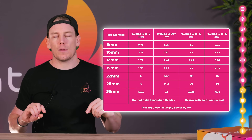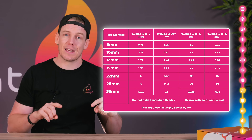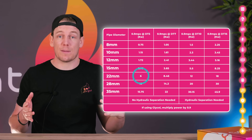That 0.9 metres per second maximum velocity is the other number shown in the top column of the cheat sheet, along with the temperature drop. So let's say you've worked out you need 7 kilowatts of power in your property and you have 22 millimetre primary pipework throughout. Primary pipework is the main pipework before it tees off to the radiators. Using this table, if we want to maintain a DT of five, our maximum is about 6 kilowatts — but in reality 7 kilowatts is probably okay, with the temperature drop maybe rising to around six or velocity going to one, which is probably just fine. There's wiggle room here. And importantly, there's no pipework that's too big — if it can carry more energy than you require, that's absolutely fine, and with heat pumps the added volume is actually quite helpful for keeping up efficiencies and achieving higher SCOPs.